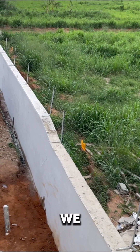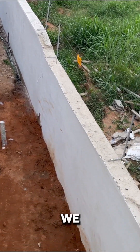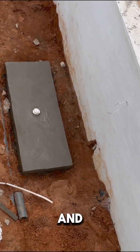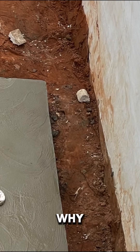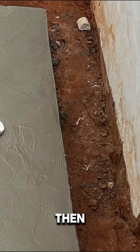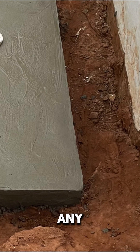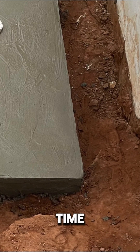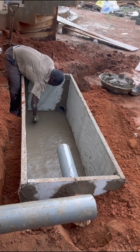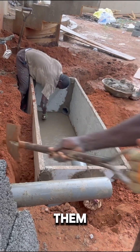The traditional soak away is what changes the whole mindset for wastewater management in your compound. For these particular digesters, we considered that same mindset — the soil is good, so we constructed a small-size traditional soak away. The number of users in the facility is not that many, and the toilets are divided: two toilets per digester, which means there will be less usage and less pressure on any one digester at any given time. For the biodigesters, we are using prefabricated slabs — we prefer them and have them erected nicely.